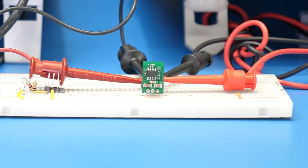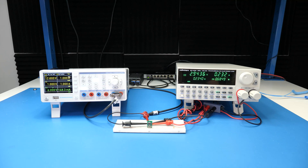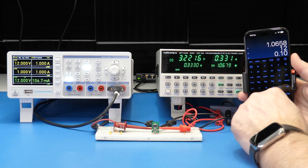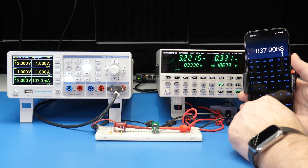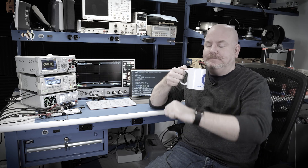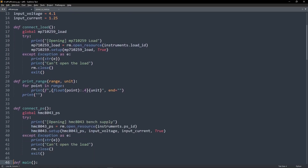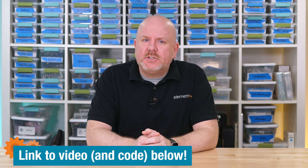This DUT is a 3.3V switching regulator from Multicomp Pro. I'm using this power supply and DC load from 15 seconds ago. With this setup, I can set a constant current value, then math the power out and power in, and finally calculate the efficiency percentage. In a previous video, I showed how to use PyVisa to automate test tools with Python to draw Bode plots. So I crafted together some more terrible Python code to automate the efficiency measurement. Setting up and using PyVisa is a 15–20 minute video, so go check that one out if you want to know more details on that process.